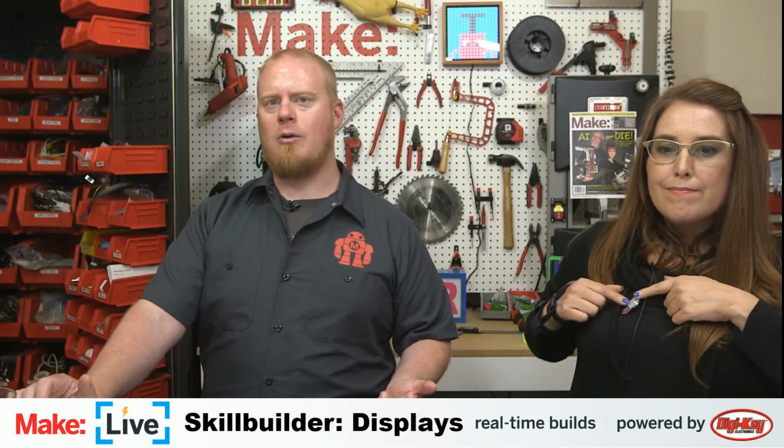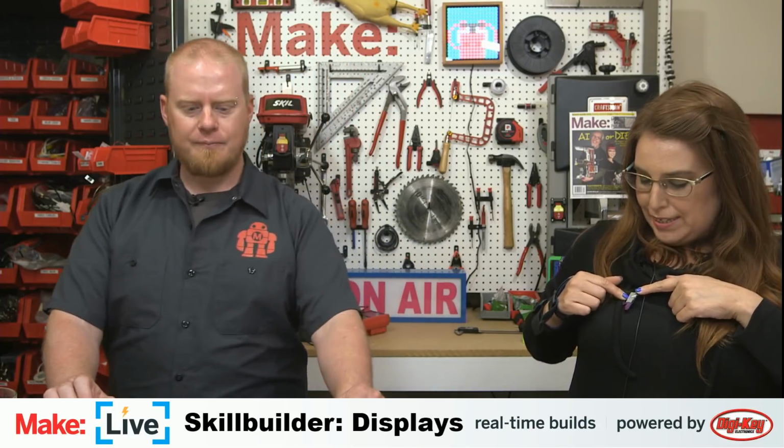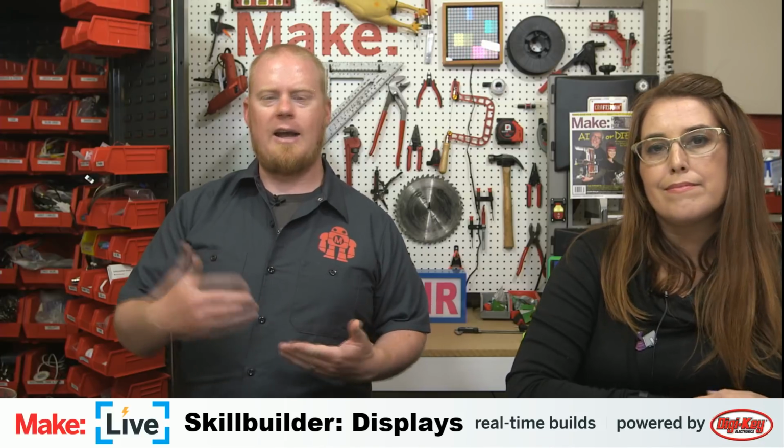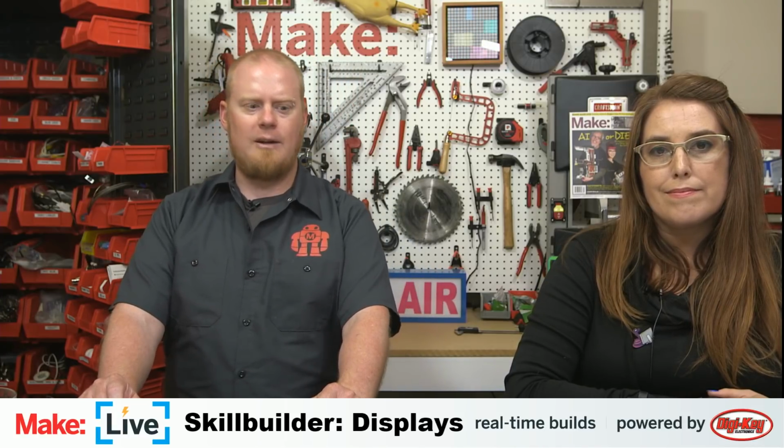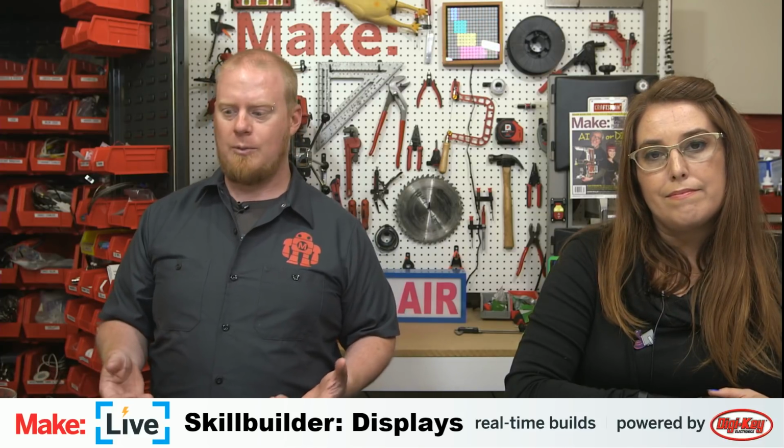Now, there is a growing trend towards what's called MicroPython and CircuitPython. This is Blinka, the CircuitPython logo. There aren't a lot of boards that you can use to program with it, but then you are essentially using Python on your microcontroller. It's a really nice interface because you plug your microcontroller into your computer, and it basically just shows up like a drive with your Python files on there. And then as you edit them, the board reboots, and you see your code changes reflected immediately.